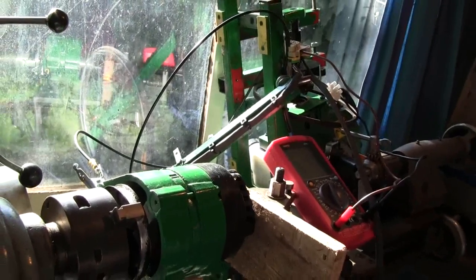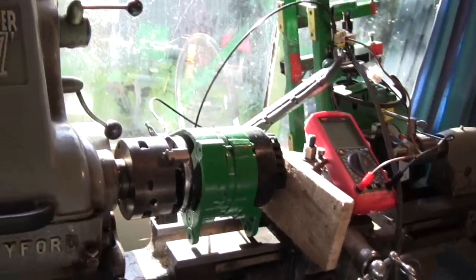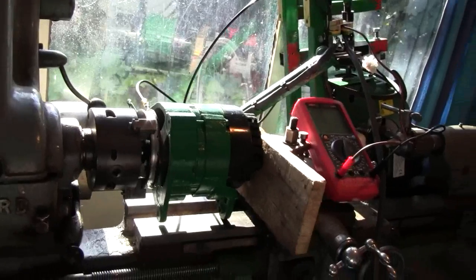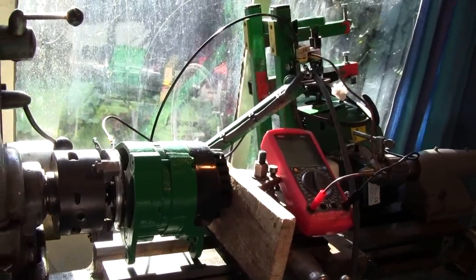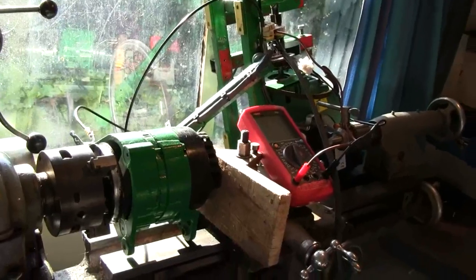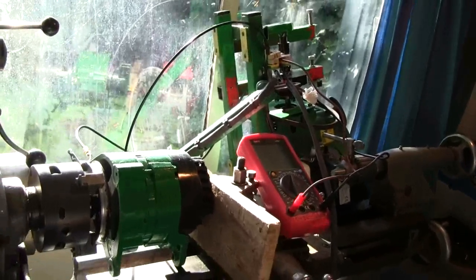I would get about two, or perhaps two and a half, amps out of it. But when the alternator was in the generating phase, when it was sufficient to start generating, the engine wouldn't run very fast. That made me think I need a higher ratio between the engine and the alternator.